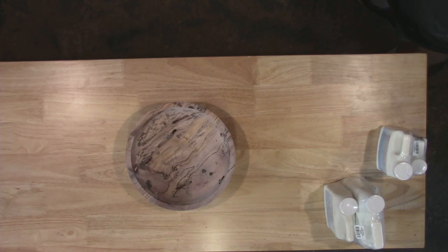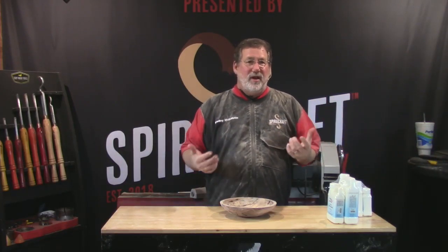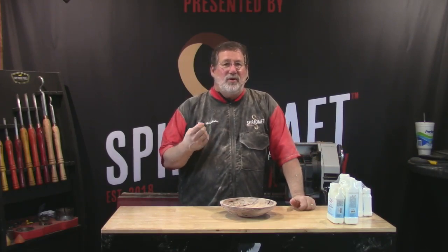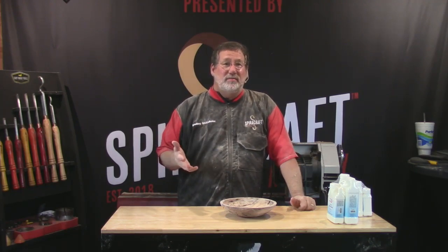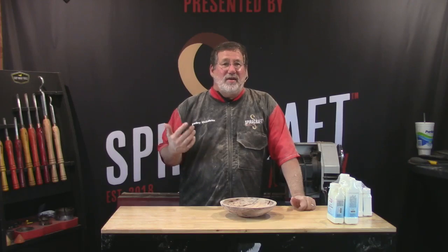You actually cannot buy a non-safe food grade finish today in the United States, according to say Bob Flexner, a finishing expert, because they took all the heavy metal dryers and stuff out of finishes. But the one thing about that, the way I understand it, and I do not profess to be a finish expert, is the finishes today do not have anything in them that will hurt you once they are cured. Even lacquer, polyurethane, once they're cured, they're inert. Now, while they're getting there, you could still get sick if you were to eat something out of it, because all the chemicals haven't outgassed yet.